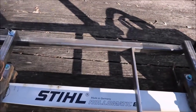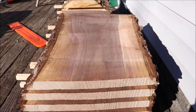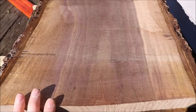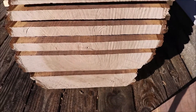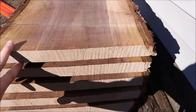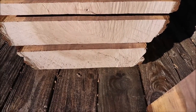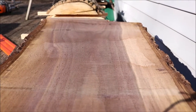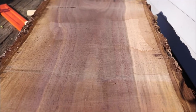I'll show you the logs I milled up here, and in the next video I'll show me actually cutting something with it. Here's some of the walnut I cut — I took the top layers off. These were cut down pretty recently, just over the past summer, closer towards the fall. I painted the ends to try to keep them from cracking and it looks like it worked pretty good so far. These here are about an inch and a quarter thick, and the ones down there are three inches thick. It leaves a pretty smooth finish, really — it wouldn't take too much with a thickness planer to clean these up, and they're just sitting out here drying.